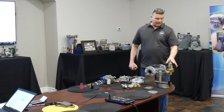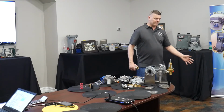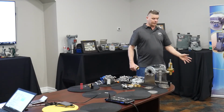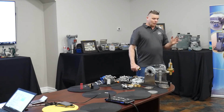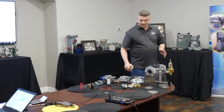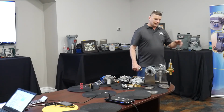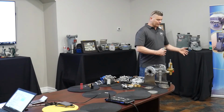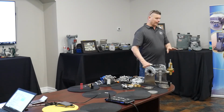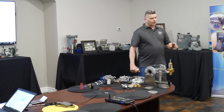If I'm going to give this pilot the ability to control this valve in a really effective way, I want to make sure, now the manual will say, well, 8 to 10 pipe diameters downstream is the minimum placement for your sense line. The critical factor here is, where's the quiet gas? What I'm talking about is, I don't want to be near a change in direction of the piping. I don't want to be near another component the gas is passing through. A change in pipe size, like a step up or step down in pipe dimension. All of those things cause turbulence.